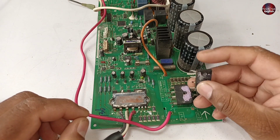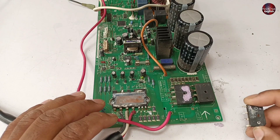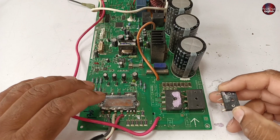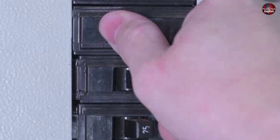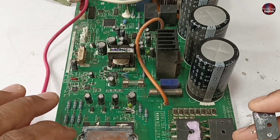The reasons for the current trip error in the motherboard are different. I have never seen in my career that the current trip error is shown due to the bridge rectifier. If the bridge rectifier is bad or faulty, it trips the MCB breaker, or it does not pass the electricity further to the rest of the motherboard, and hence it is considered a dead motherboard.